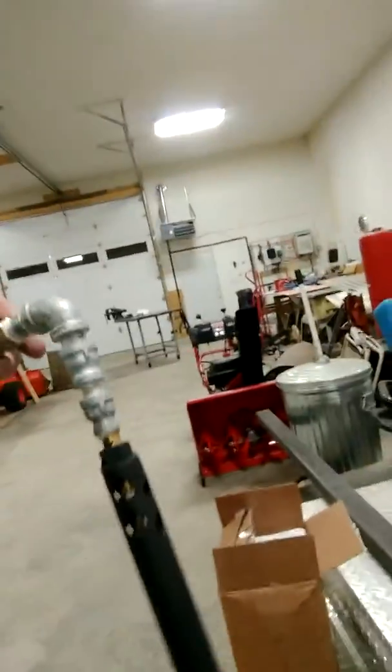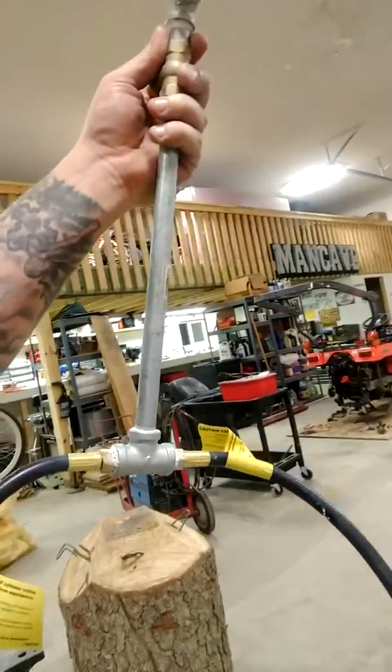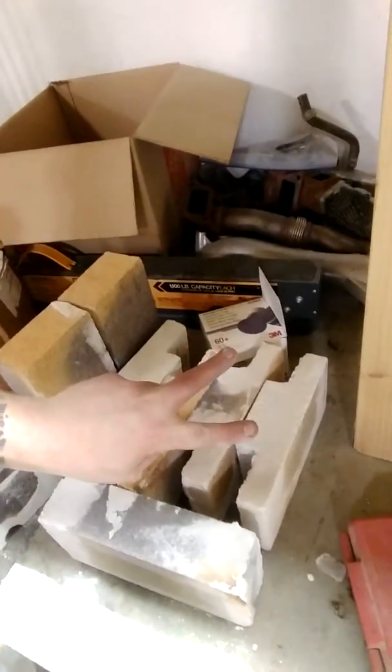I ended up making this whole assembly here, as you can tell, through just hardware parts that I found at my local Menards. And what's in that bag is the uncut version of that, which is an aluminum silicate style high temperature insulation. And then I got regular fire brick from my local company around here. I'll show you those. So what I ended up having was 2 bricks wide.